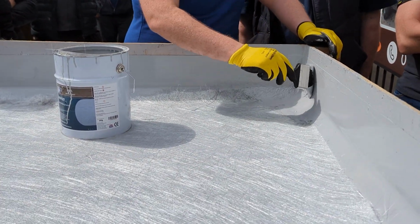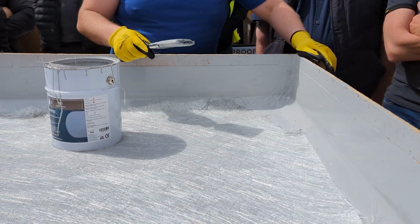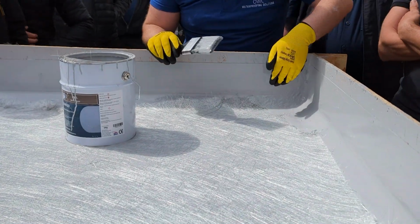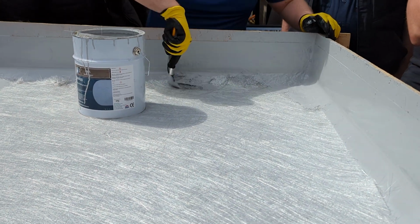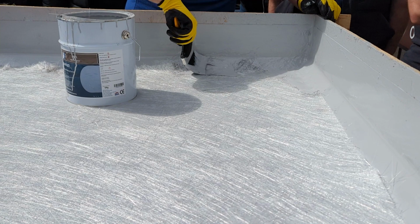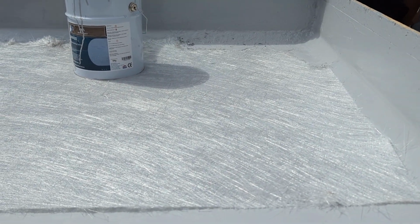See that, George? That's the new matting there. I purposely put it in the corner there. And see the way I've just rounded it just by touching it. Is it powder wove or something? Powder bound, yeah, powder that's bound. It's still fiberglass, but it's not emulsion bound or emulsion matted. So it's using powder as the binder, so it breaks down nicely when you're using it.